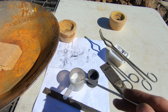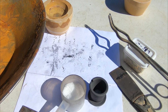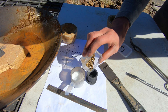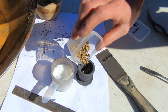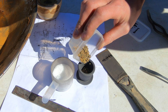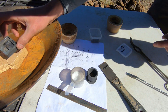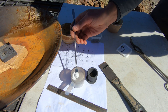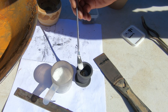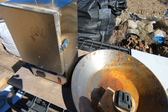The borax will potentially help coat the bottom of the crucible so all the gold pours out. It will also lower the melting point of the gold and remove a little bit of impurities from the gold as well. Now we're just going to load in a little bit of gold — that should do it right there for the small cavity. Put a little bit more borax on top and we're good. Let's load her up.